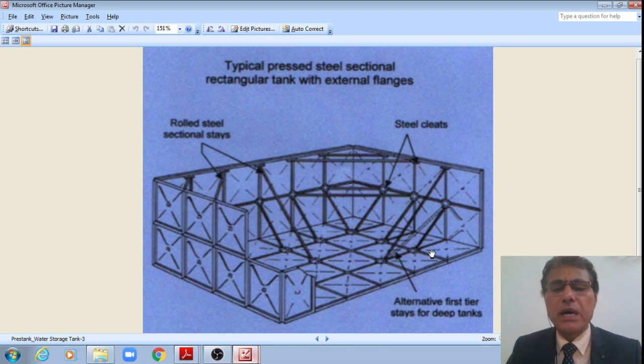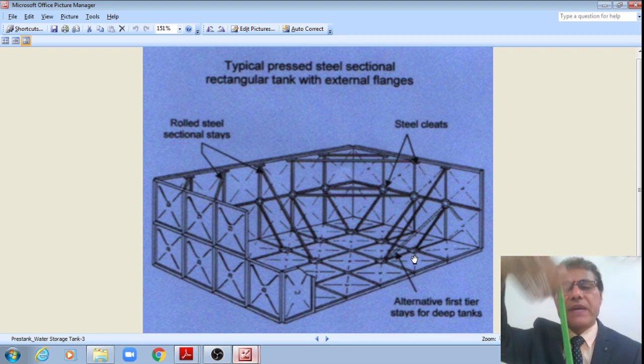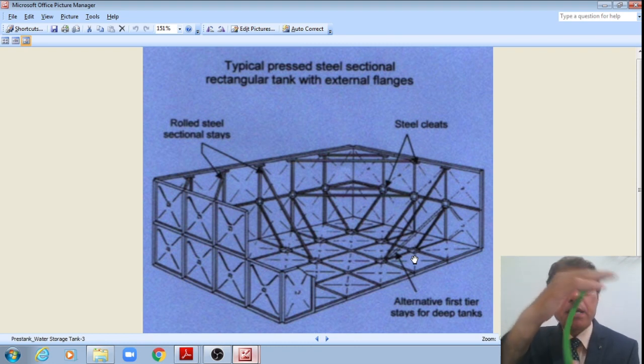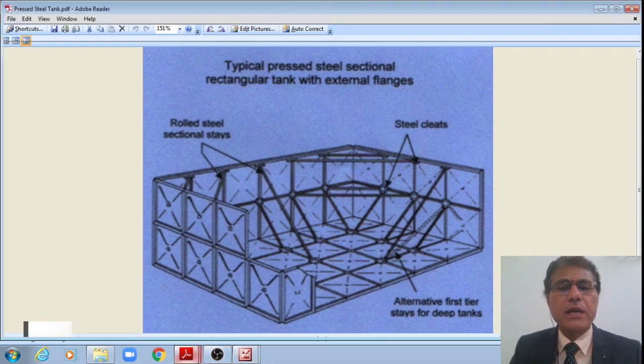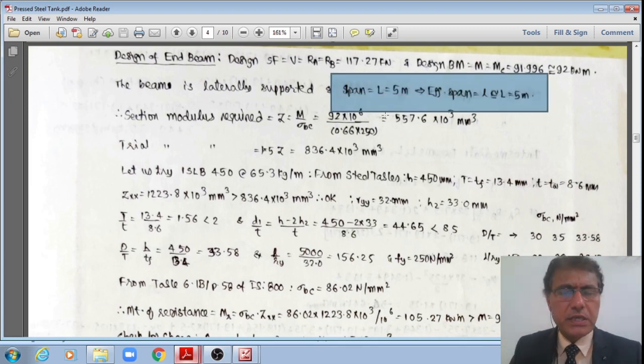These longitudinal girders are connected by means of the stays, which are connected to the longitudinal girders. Therefore, the compression flange of these girders is connected by means of rivets in the flange part. Therefore, they cannot buckle, they cannot bend in the lateral direction. Hence, these are laterally supported beams with a span of 5 meter only, effective span, because these are